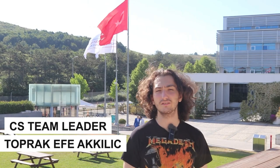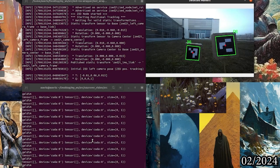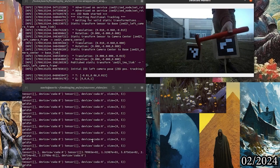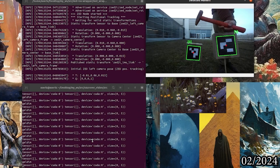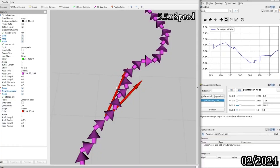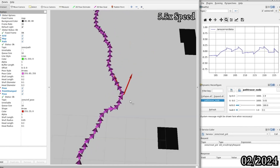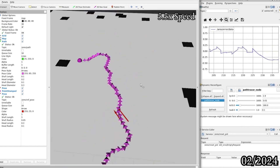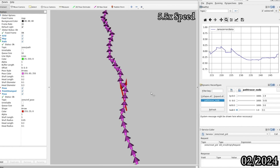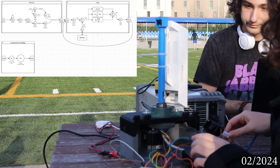The robot incorporates an autonomous navigation system that accepts delegation of target positions coupled with ArUco markers. Goal points are stored in a local queue managed by a central state machine which handles controllers, lists utilities, and listens for detected goal objects. Localization and mapping are handled by a stereo camera on the chassis to achieve reliable odometry, and a trajectory controller navigates the robot by following a segmented path.